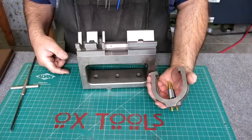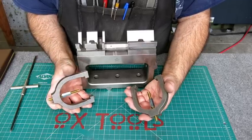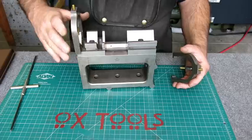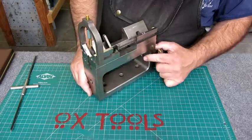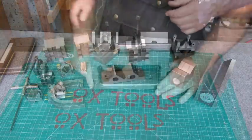It's got a couple of clamps — nothing super fancy about them, they're kind of big — but you can put a fairly large diameter round piece in here. The V-blocks on a rail so they can move around. For things that have a boss in the center, you can accommodate that bulge with the notches. Big holes so you can clamp it down, hollowed out so it doesn't weigh a ton — although it's not a lightweight by any means.